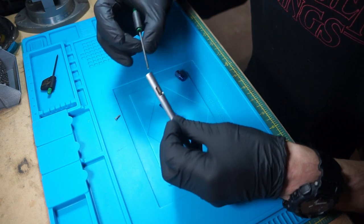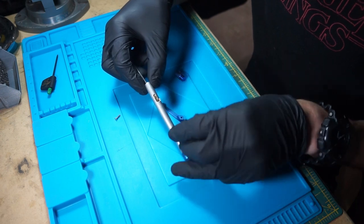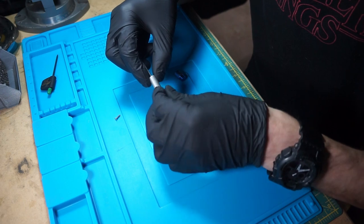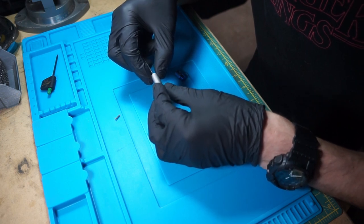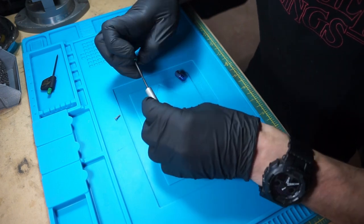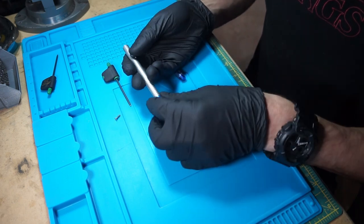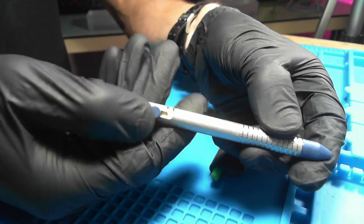I take the little tool and put it right in the screw in the back, and that lets me tweak it. The reason the flat is on there: I might eventually put some engravings on that flat, but it also lets you push this pin in and it butts up with that flat, which helps you align the position for getting the thumb stud in correctly. I've already put this in once, so I'm just going to line up where the set screw already made a mark. You just slightly tighten it — you don't have to go crazy because it's already a nice tight fit. I just check the cycle, make sure everything is nice and happy.